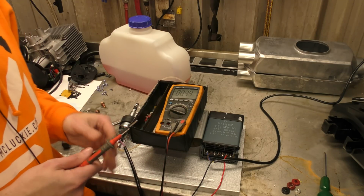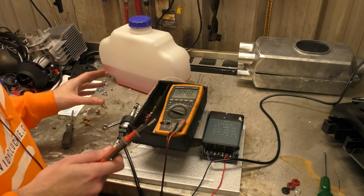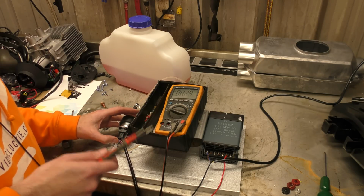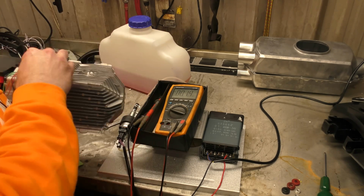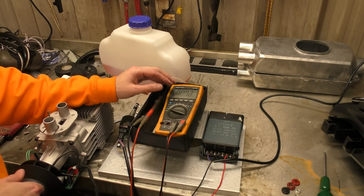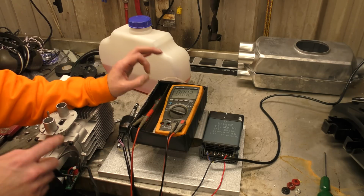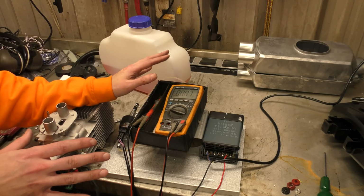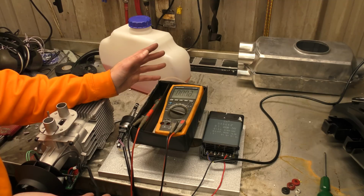Alright, folks, I'm genuinely perplexed as to how they have a 24 volt heater running on 12 volt components. I don't understand. Does it work the other way? I mean, they sell a 24 volt motor, and a 24 volt fuel pump, and a 24 volt glow plug. Because if you use a 12 volt glow plug at 24 volts, it gets super red hot and then burns out really quickly.